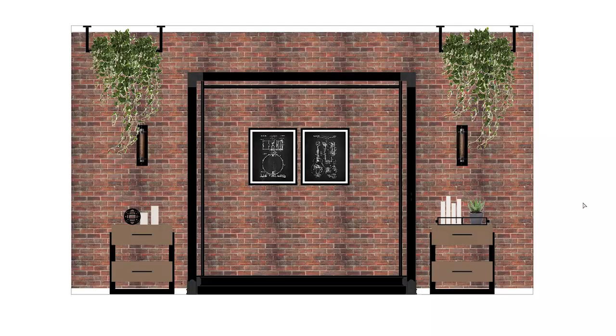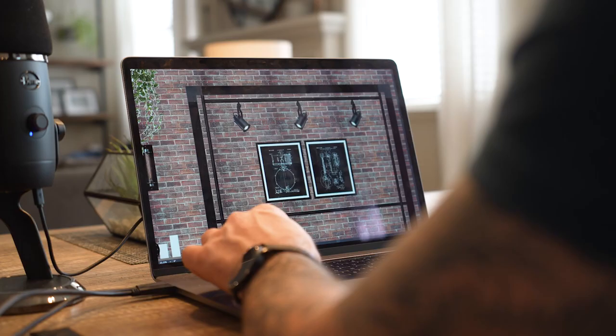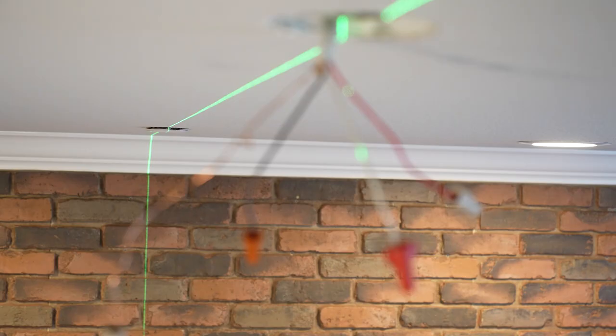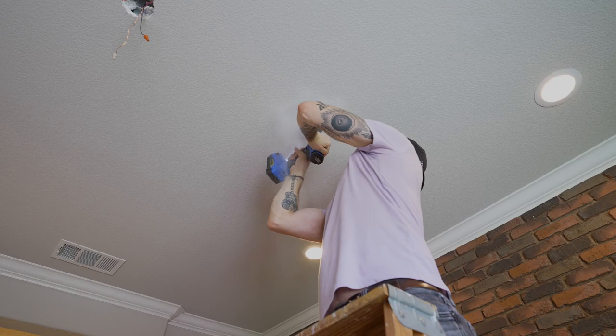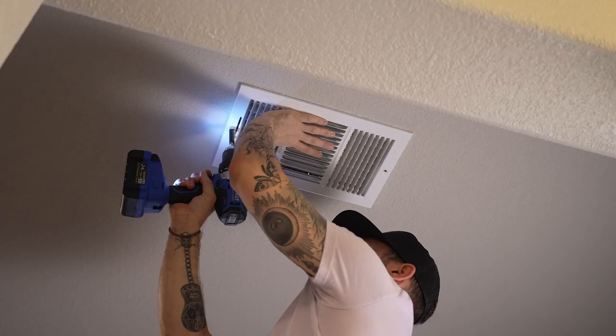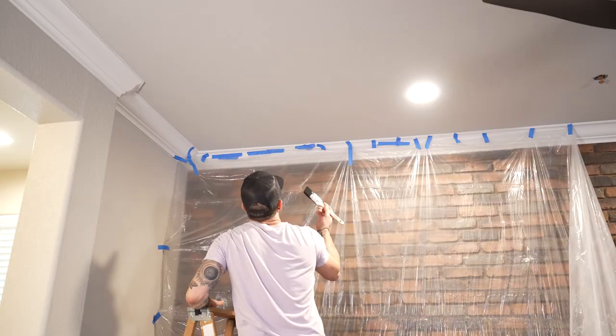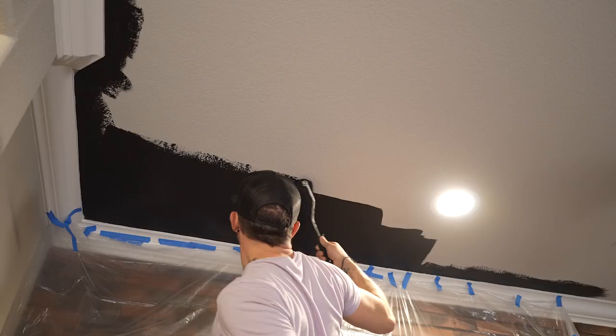To start I used painter's tape to create a quick mock-up and gather measurements, then transposed those measurements to a visual mock-up I created with Illustrator. Once I was happy with it I created plans for the top and front view at 100% scale, accounting for actual lumber sizes, pipe accents, and ceiling fan location. The fan needed to be moved and centered over the new bed before it became inaccessible from the canopy height. I also took the opportunity to paint the ceiling vents and covers black and found retrofits for the recessed lights with black trim.